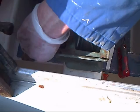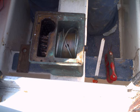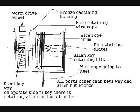First of all you get in the boat, you disconnect the centre housing and get the pin out. Holding that drum and that worm wheel in place is a keyway on the worm wheel with a little centralising screw opposite it — that doesn't actually go into the bar — and on the drum is an Allen key down in that hole there in the centre.